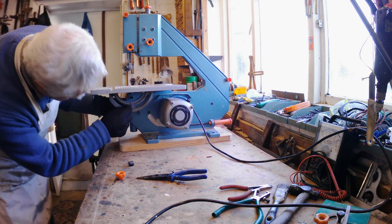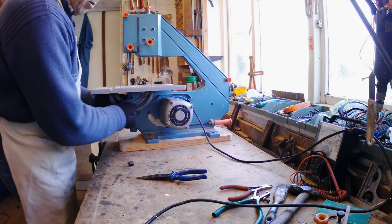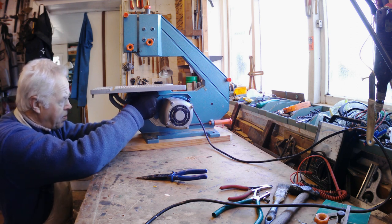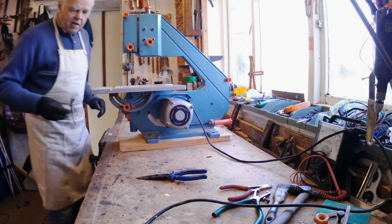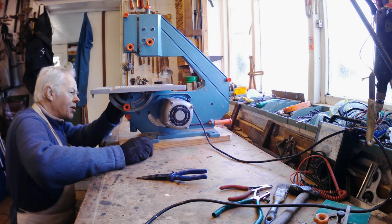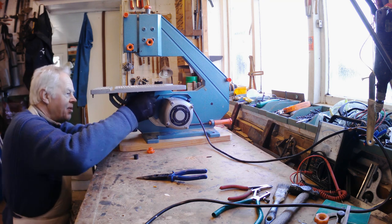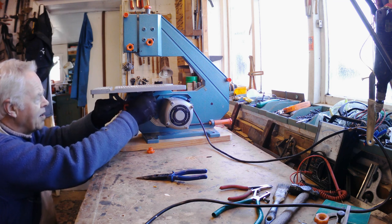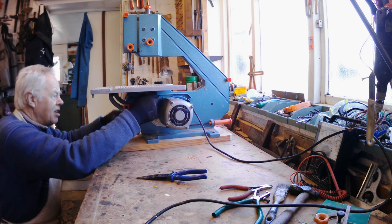There's a spacer and then these plastic knurled knobs with nuts inside — that just goes in there and holds it, same on the other one. But this one's more awkward because the bolt keeps popping through. The bolt head is right behind the pulley where you can't get to it, so every time you try to put the nut on it pushes the bolt in. I'll put a little screwdriver in to hold it tight. That's it — I've got it on now. Poor design, folks.